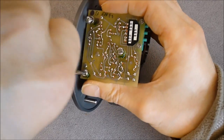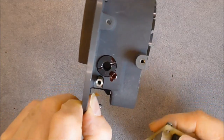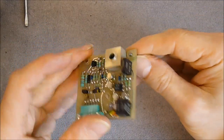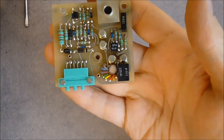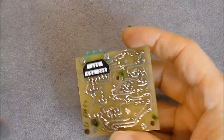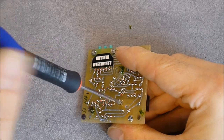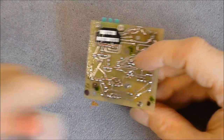Yes, it is coming right off, so no issue here. By the way, yes, we have some pickup on the side of the prism, and we have this little PCB. Just transistors. On this little shielded box, let me find a screwdriver. I should be able to open it. It was not difficult. Just two screws to unlock, and maybe this little cover will come off. Yes, it is coming off, so it should allow us to see which kind of sensor we have in here.